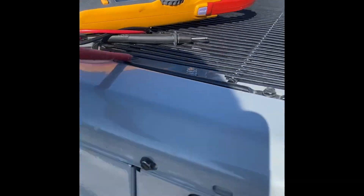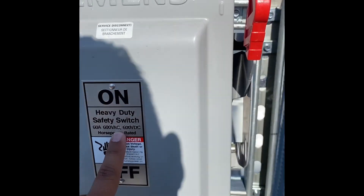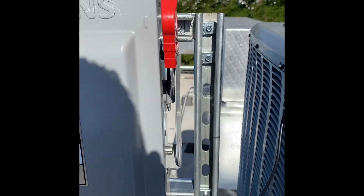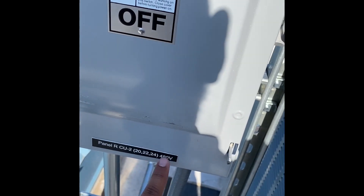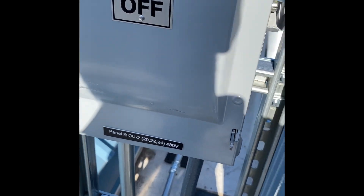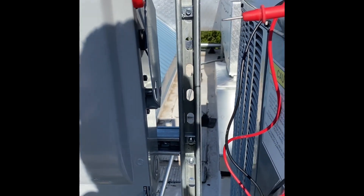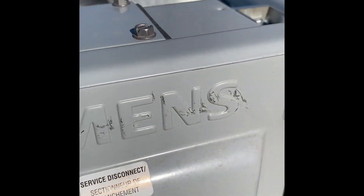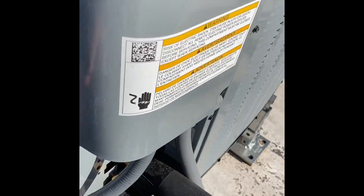As you can see, the fan is going at a million miles an hour. We got a Siemens 60 amp, 600 volt, horsepower-rated disconnect — so it's meant for a motor. The 600 volt means it can handle up to 480, because we typically work with 120/208, 120/240, or 277/480. This is a heavy-duty 600 volt unit. It's a NEMA 3R — you can always tell because it's got the little cap on top. It's a fusible unit, so anything with a motor has a fuse.